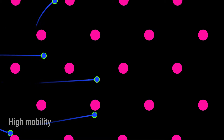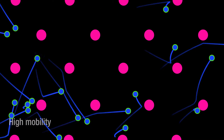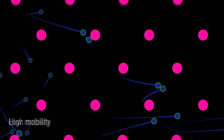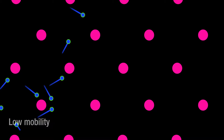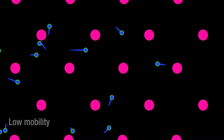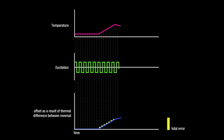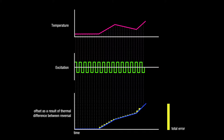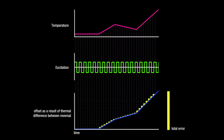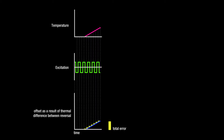The time it takes to reverse field has limited the use of permanent or superconducting magnets to the measurement of higher mobility materials. With Fast Hall technology, any magnet type can now be used to measure semiconductors with low mobilities, offering greater flexibility to researchers studying the transport properties of semiconductors. An additional benefit of the M91's speed is improved measurement accuracy — longer measurement cycles allow thermal changes to creep in as a source of error, while Fast Hall's reduced measurement times mean less temperature differential between measurements and therefore less error.